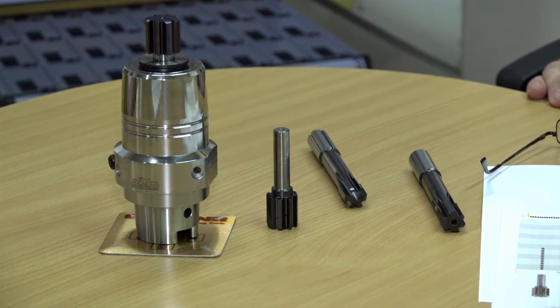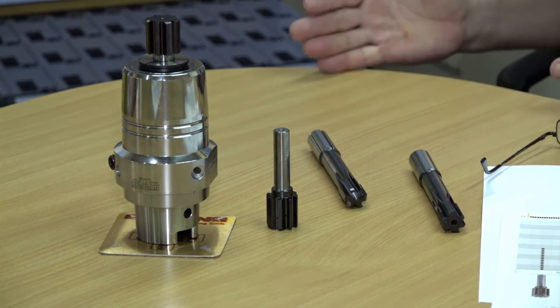When it's worn, can you re-grind it? We have the facility here in Birmingham where we can re-grind and re-coat. We can also wet blast it so that gives us the surface finish we require. Because we use our own coating machine and our own process, we're able to control the actual thickness of the coating — which is important in reaming, as you can lose the tolerance if you can't. We can de-coat before we grind and then finish coat thereafter.